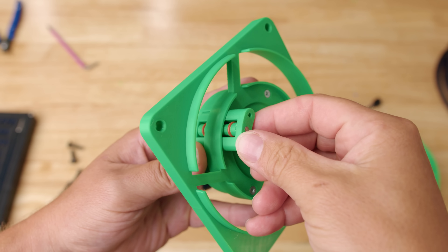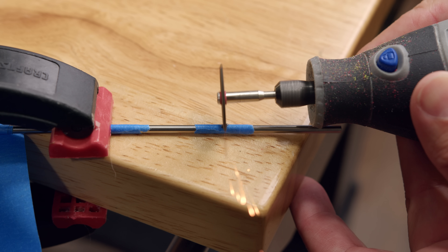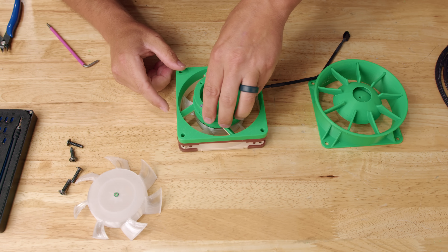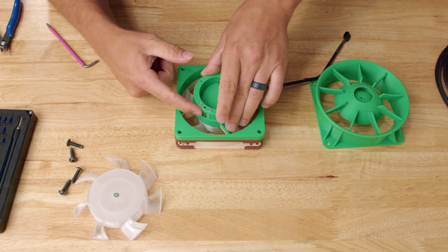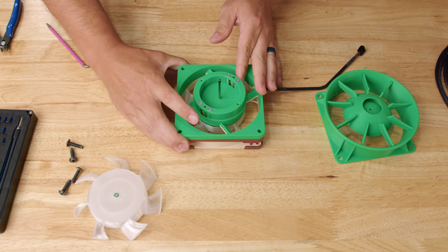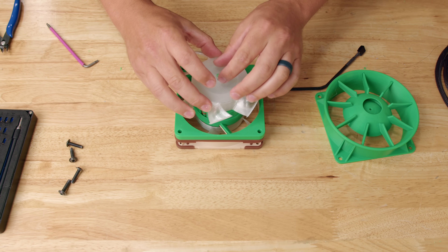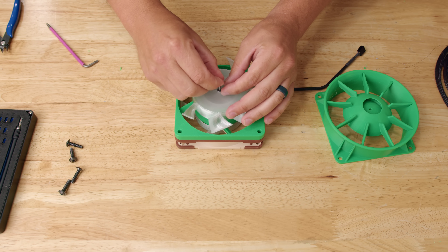The drive assembly is bolted to the spacer plate and is comprised of essentially two rollers. These two rollers are made from a shaft — one long shaft cut into three pieces, two of which are used in the rollers — which go through a 3D printed spool with two bearings on each end. Additionally, two small O-rings are added into specific points on the spool itself. When you attach that to the spacer plate and lower it into the fan, those O-rings contact the drive fan within the cutout cavity, transmitting power from the drive fan to the driven fan. Because the spools drive the upper fan from the lower fan, the driven fan spins in the opposite direction at the same speed.